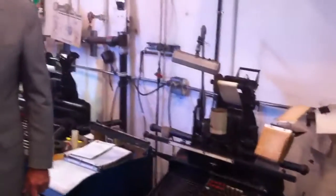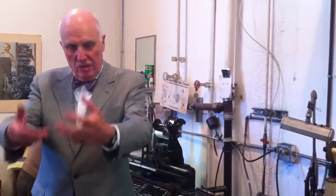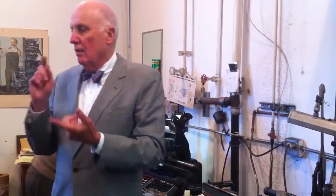The paper tape — after you type something out, you bring it over to one of those casting machines. The spool is activated by the machine. Each of those machines requires electricity for the electric motor, gas to heat the pot, lead to make the mold, compressed air to go through the holes, and a water line, because you have to keep cooling the mold so it doesn't get too hot.